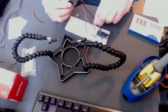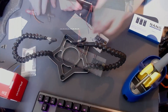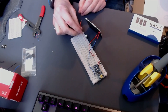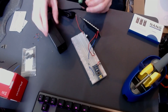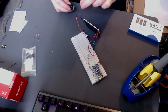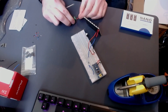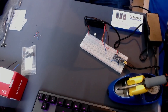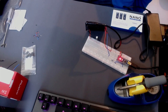Once you've got your components in place, the power supply in, and you can see that your Nano is actually receiving power, you can go ahead and move to the next step of installing SimHub and getting your sketch in place. We want to make sure we've got our orientation right for the screen, and if we're seeing any issues now we can start to adjust. When you wire up your matrix, make sure you are connecting your jumpers to the data-in and not the data output — that's more for daisy chaining future connections, and as we're only using one matrix with this project, we don't need that.